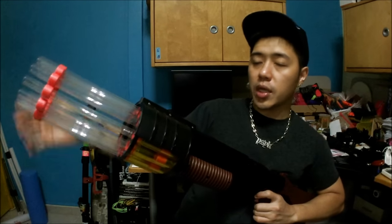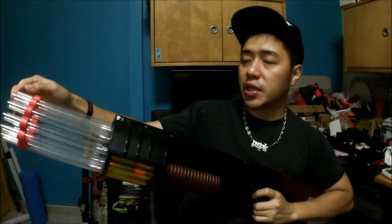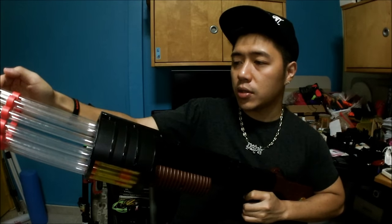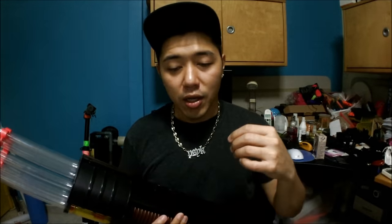Actually, it's not a 100% seal — I've never really tried it out, but let's go ahead and try it. It's not. I don't even think the leak is between the turret — oh wait, yeah it is, you heard that? So applying a bit more pressure... it's a slight leak at the plunger-to-turret seal, and that's something you would have to really tweak. You want to find the perfect balance between a good seal and a good working rotation mechanism. I got a little bit lazy on the rotation arm this time, but it's working really great — firing off pretty hard and solid.